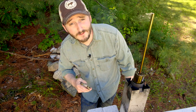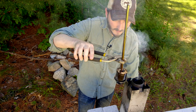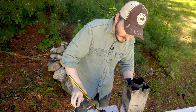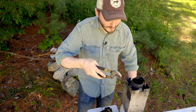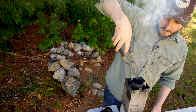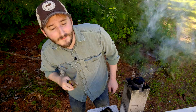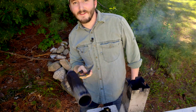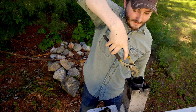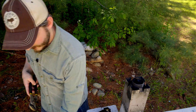My wood gas production is now slowing, so it's the moment of truth to see how well this design works. I'll lift the lid off the wood gas container. I'm very happy with how well these sealed — the tar dripping off did a great job sealing the stainless steel cups to the reaction vessel. Now let's see if I lift this up whether the charcoal will drop out. My container is empty — the charcoal fell right out and down into the base. I can put it right back into the furnace and refill it. Let's see how quickly wood gas production resumes, because that is equally as important.